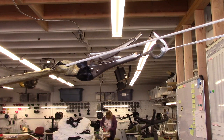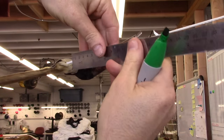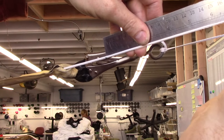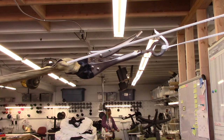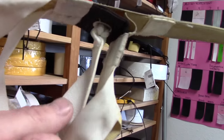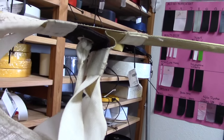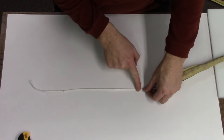What we're going to do now is place a mark that's three inches from the very end of the bridle, then another mark that's 10 inches from that. It's okay if you don't have a fancy setup like this — two guys with two scales can do just as good a job. When you've got the bridle and kill line under tension, if you've done your job right, the center post will pull up so the lark's head knot is touching the guide grommet assembly but neither of the set limiter tapes are fouled around anything. We can see those two marks: the one three inches from the end of the bridle under tension, and the mark 10 inches on from that.